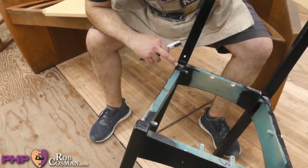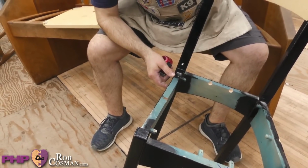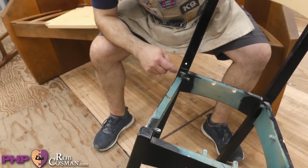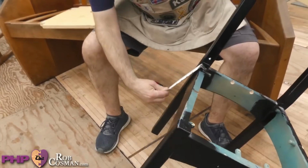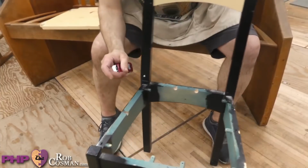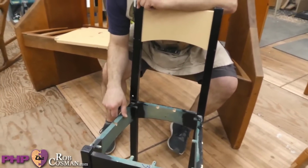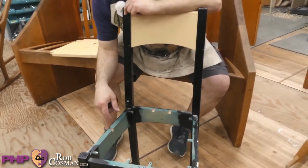Now, you don't need much shoulder. So in other words, I can make that tenon quite long. All I need is enough shoulder to cover the joint. So let's say I had 1/8 of an inch at the top and 1/8 of an inch at the bottom. Then my tenon is now going to be 3 5/8 of an inch long by 1/2 inch wide. Now that's a piece of maple, and that's plenty strong. You would never break a 13/16 inch thick piece of maple in this application, and I'm going to guess and say you'd never break a piece of 1/2 inch either.